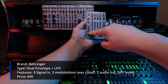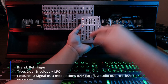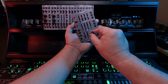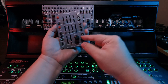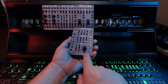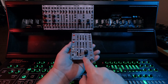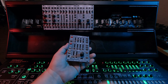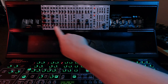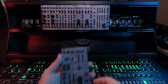So this is an LFO with a frequency in, a trigger in. You could set the frequency ranges in low, medium, high as far as how fast this frequency goes. And you could pick different shapes of your waveforms for your LFO. And here's a normal and an inverted LFO out. And down here is a normal LFO output or a 1/10 LFO output. If you have it on times one, the LFO coming out is the full sweep, but if it's on 1/10, it's smaller.